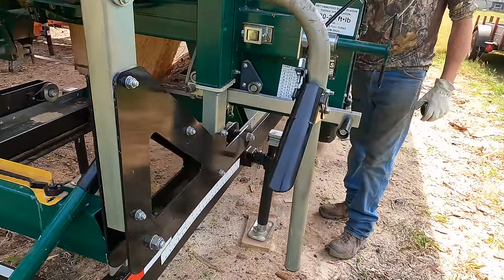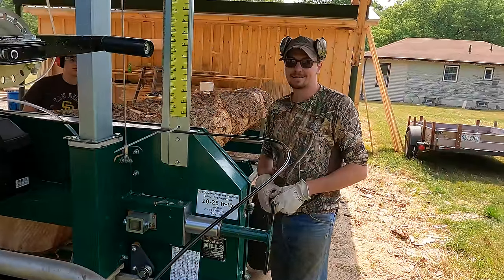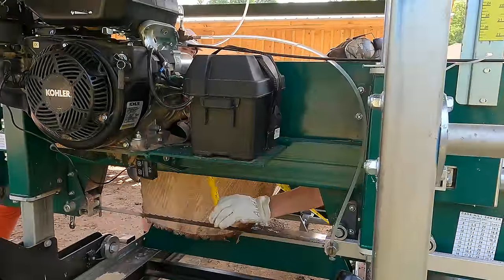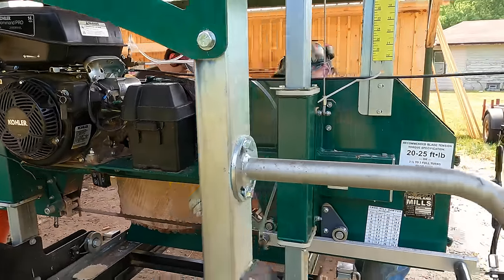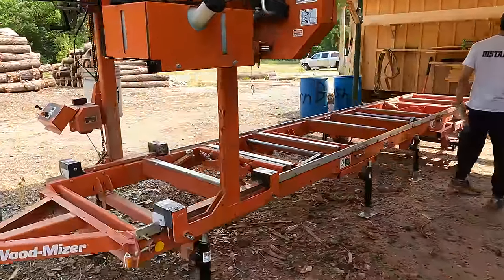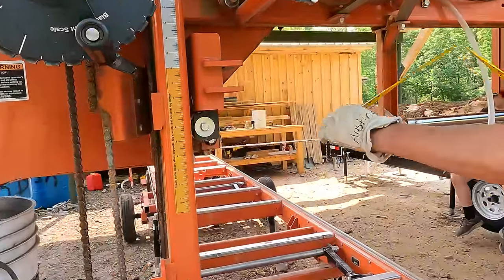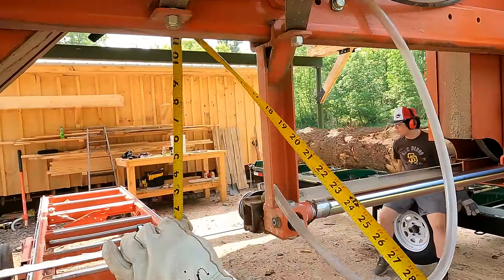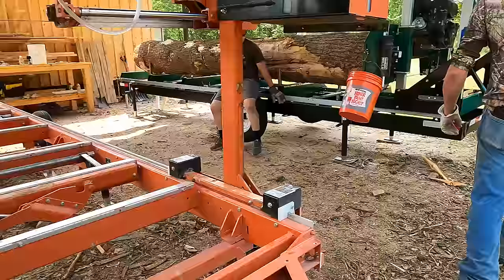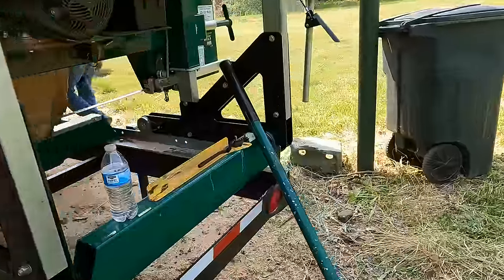What's important on a sawmill is the bigger throat. Issue that we have is making your 4x8s. I have to be careful which way I cut, because I only have... Oh yeah, you got to cut 4 high, right. I only have 7.5 clearance above the blade. Come and measure this above the blade. I don't even know what it is. It looks similar, but I think it's closer to 10. More. So you're getting like 11. 11, okay. Which is nice, because we have run into that issue. All right. Well, what do you think? Is it worth jacking it up for the 1 inch of paper?